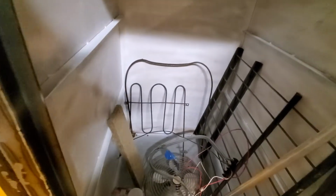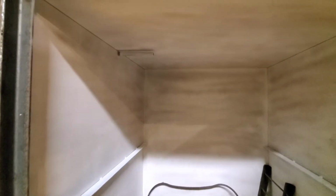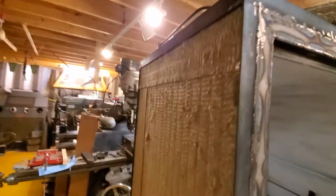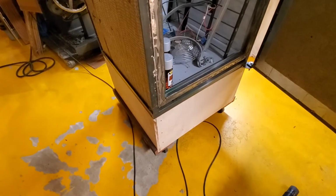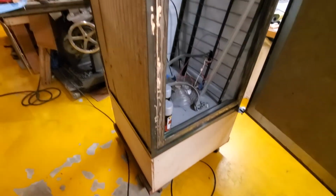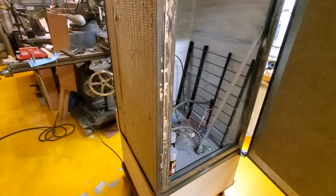The heating elements pop through the floor in the back, and then there's the fan, and the thermocouple is going to be coming through the ceiling, so it has to go in from a wire all the way from there up underneath this insulation, or maybe outside the insulation, and then go down into that lower box to attach to the control panel. So that's why I need a longer cable. It's a little longer than 6 feet, and there's no intermediate, so 11 feet will have to do.